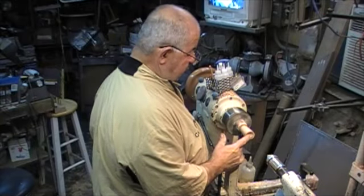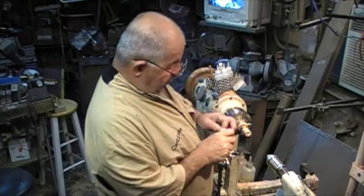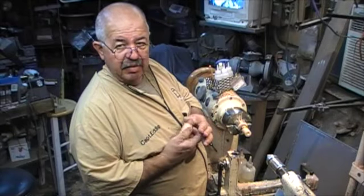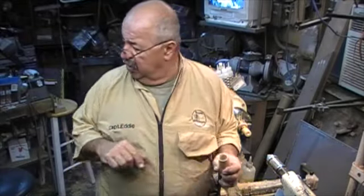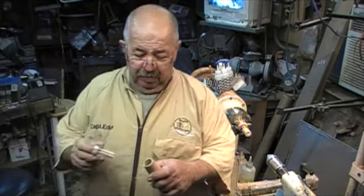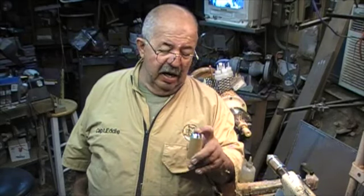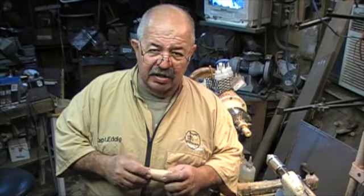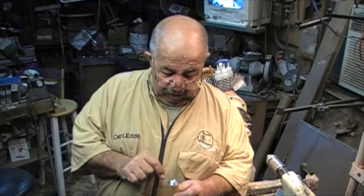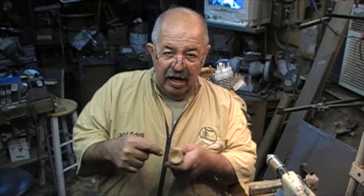Now, back to this project. We have this done. Take it off our mandrel here, all right? And we're going to clean up that edge a little bit. Remember, you may want to seal this top edge with at least a sealer before you put your piece in. And when you do put your piece in, you want to put it in with an adhesive, not super glue or anything. The adhesive can be as simple as that 6000 stuff that looks like silicone. You can actually use some tub and bath silicone. And when it's curing, you can center it all up so it looks even all the way around, because it's a little bit loose on a 1-inch thing. And don't forget, sign your name on the bottom.